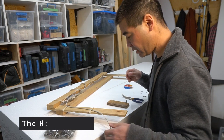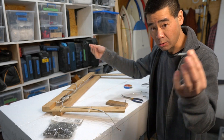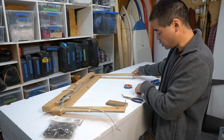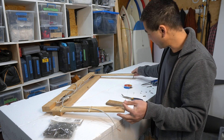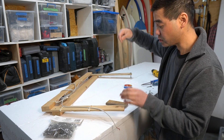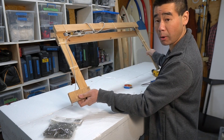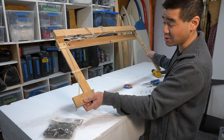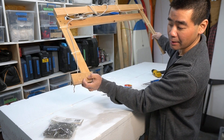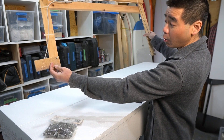I've realized the bow itself actually does fit, but the spring — which adjusts for wire stretch during use — gets in the way because it falls into the cutting area. So instead of building a new bow, I'm just going to add a block of wood to extend it so the spring ends up outside the cutting area, giving me a full piece of nichrome wire going across the opening of the bow.